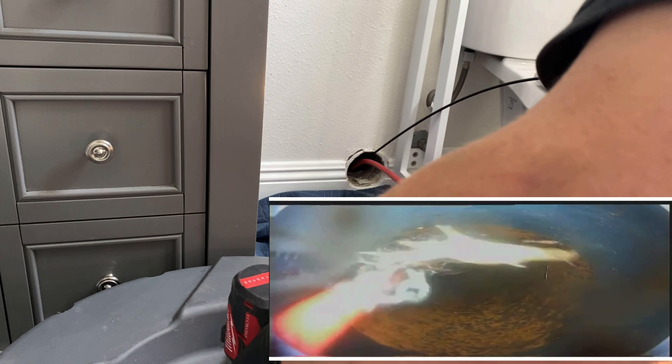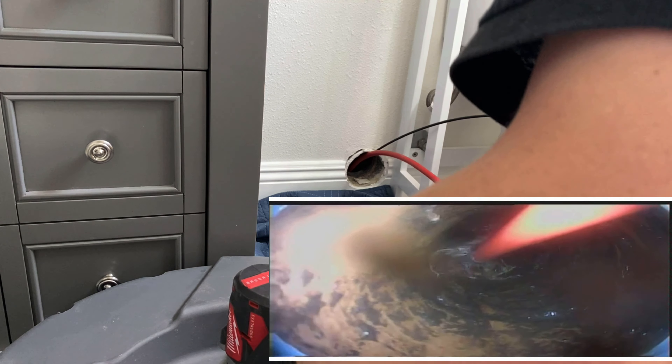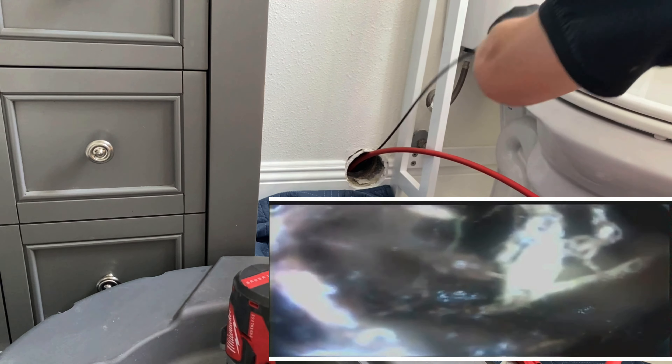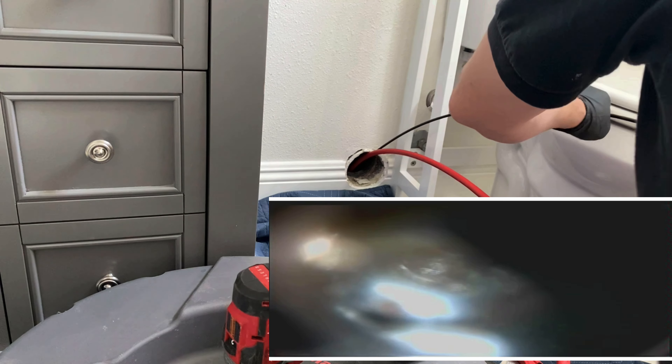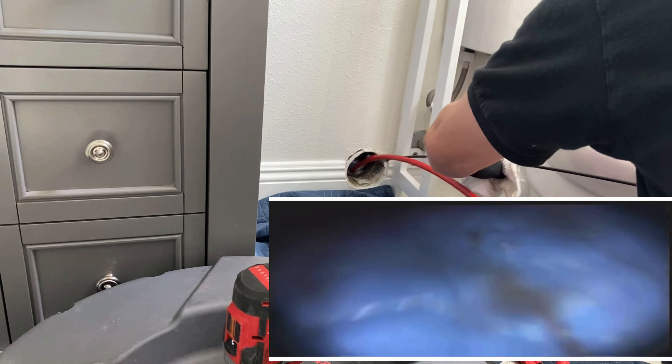I had one scare when I first bought it — I bought my K9204 used and it was missing a piece inside, so the cable had flipped over and almost snapped itself, just like the previous owner had snapped it. But the cables are really easy to replace on these — I think I replaced it in like 30 minutes. I did a video on it I'll upload at some point. The K9204 and K9102 are basically the same machine — the 204 has a three-eighths cable and the 102 has a quarter-inch cable; that's the only difference. The drum and everything else is the same.